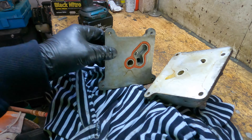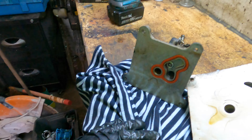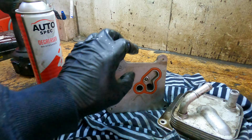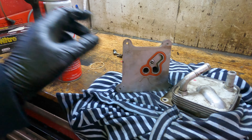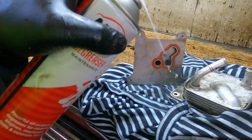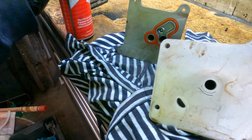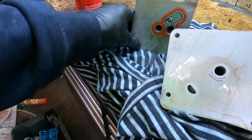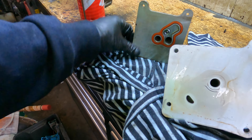Everyone can do it. What we do is clean this one, clean all the inside, buy a new seal, put it on and we'll be bingo - super easy, because it's been flat down. The oil pump pressure coming out is very strong, so that's why it circulates around here and this unit cools the oil down - it's like a condenser. You can see the oil mark here going out - that's no good. Just put a new one on and it'll last forever.